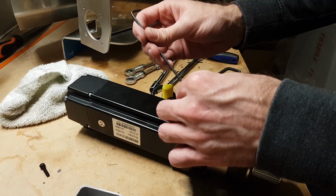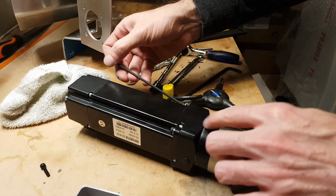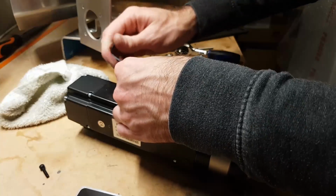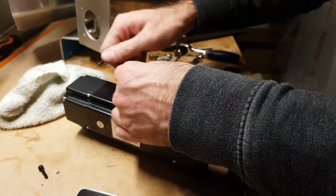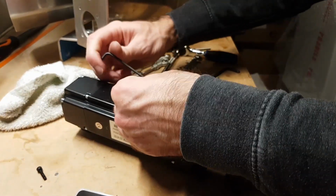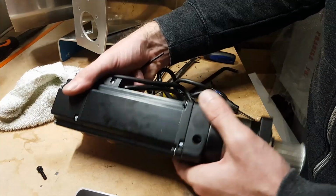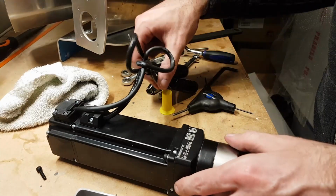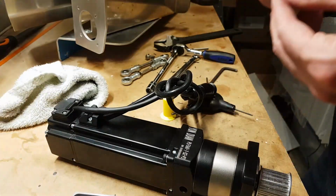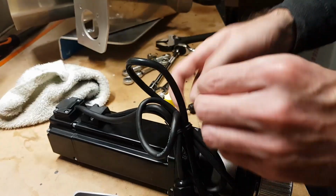In my original first iteration with these, I actually thought the interface between the servo and the gearbox shaft was slipping. So I had a friend who's a master metal worker, hi Bruce, make something that helped key out of here into the clamping collar. But in the end, I think it actually just turned out that the belt was slipping, and it just felt like the shaft was slipping, just because of the noise. It made a very metallic mechanical noise.